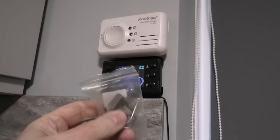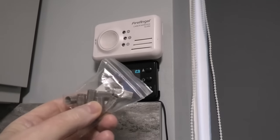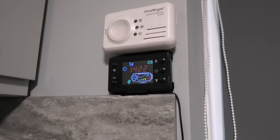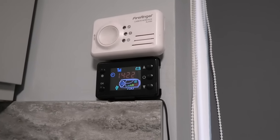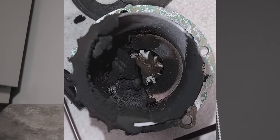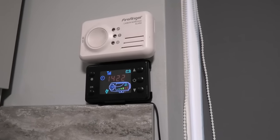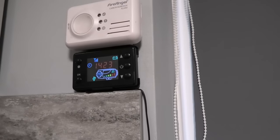These gauze atomizer glow plug things — I think they cost about six pounds for ten. That's the main part that cokes up. Before I tuned this, it ran for about three months before I had to take it apart and clean out all the coke. It was in a really bad state, so I decided to try and tune it to make it run efficiently — no black smoke, no fumes, as clean as possible. I found these things are very badly tuned from the factory.